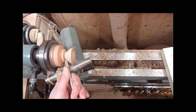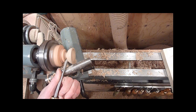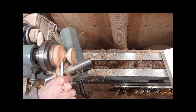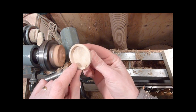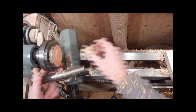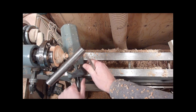I'm going to bring this down here — I want to leave it on there because I'm going to turn the finial out of that little handle. I'm going to use the parting tool here to part it off, then go ahead and create a jam chuck for that little recess and top it off. I'll turn the tenon down there and finish up the little finial.